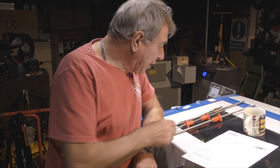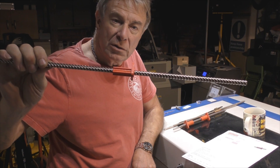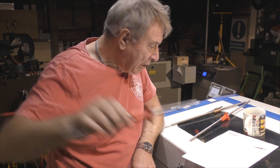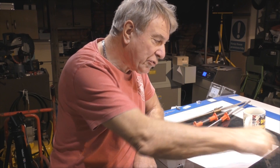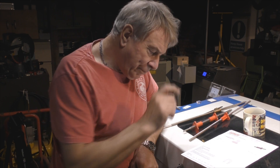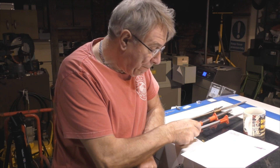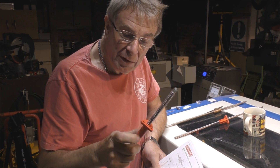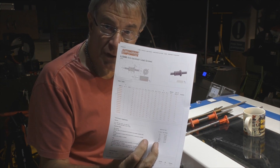Hence the question: is it curtains forever? Because while I've got a timing belt, I've got a problem. It's something I've been mulling over for the past year. Just recently I was pulling through some of my old shelves and came across my collection of lead screws. This one is probably just the sort of thing we need — it wouldn't be particularly difficult to put a lead screw along the gantry and drive the head backwards and forwards with a lead screw from the motor on the end. That would get rid of the belt.